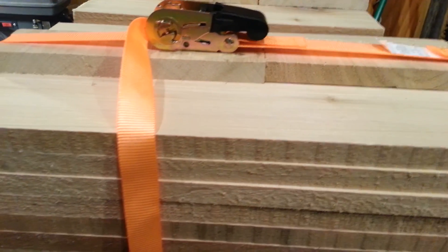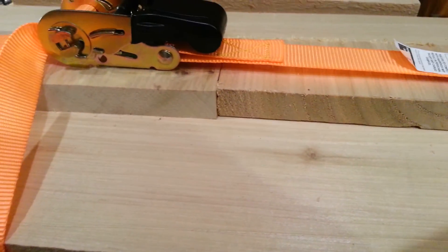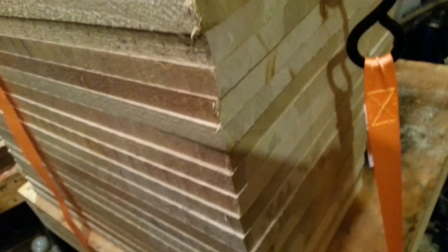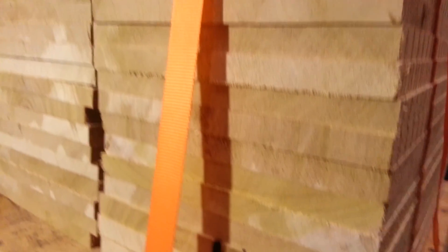Here's a quick tip regardless of the type of boards you're using. These had a little bit of a bow in them — once you stacked them up you could see gaps in that stack. I want them to be as flat as possible and try to get that cup out of them. What I did was take a couple pieces of scrap so that the strap could bite into the scrap wood rather than the ends of your good boards. Wrap those up — these are on a routing table — and torque that down pretty good. As you can see on this stack, same batch of boards, they are laying nice and flat together.